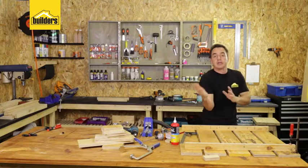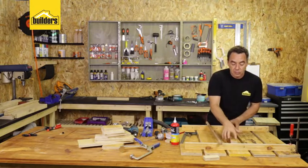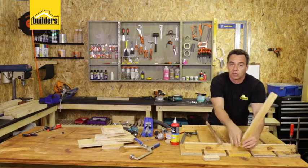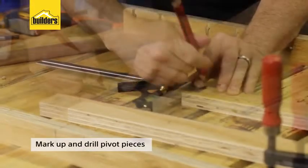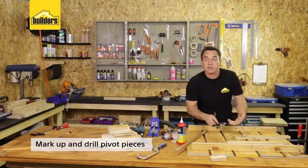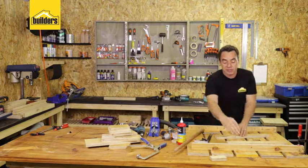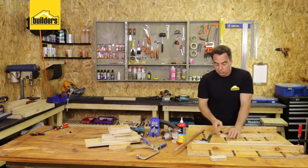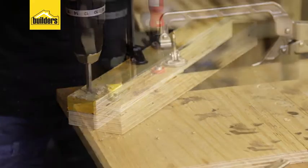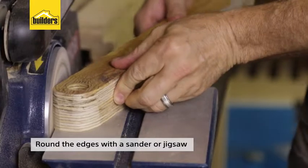For the ratchet lever mechanism — which is your height adjustment on the backrest — I need a 22mm hole on this end. I'm also going to round the edges so it rotates nice and smoothly and those corners don't catch the base. I'm going to mark 22mm on both sides: one side will have the 22mm dowel stick and the other will be the 8mm bolt hole. I'm marking up the edge to get a nice rounded surface since it's going to be rotating. First I'll drill my holes — 8mm one side and 22mm the other — then use the sander to round these edges.